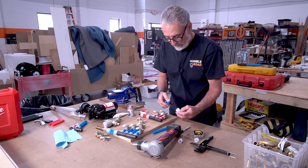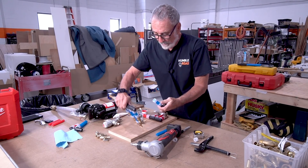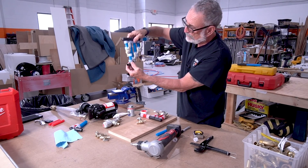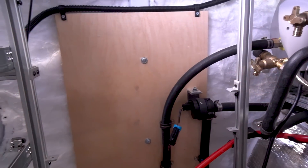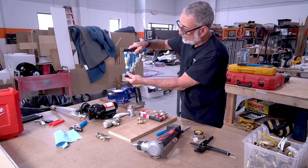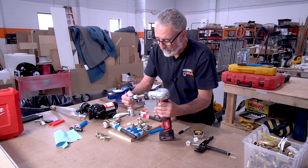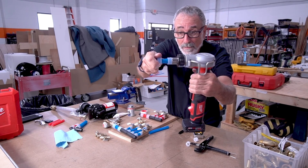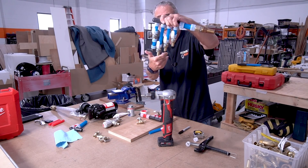Every connection point needs a collar — a little white collar. What I'm doing here now is putting this on the bottom of the first zone because I know this one's going to the cold water in the galley. My whole manifold is going to be under the galley in the rearmost cabinet against the back wall, where I mounted a backer board. So this is on the side of the van, heading forward to the sink. I've got my elbow ready, I stretch this out, done.